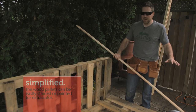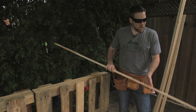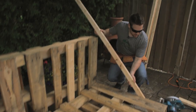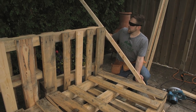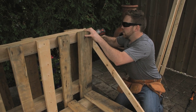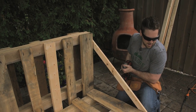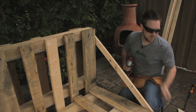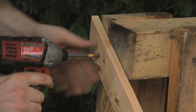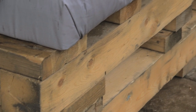So we've got everything sanded down, we're almost finished. You don't have to do this, but I'm going to add a piece of strapping to the end — it's just going to sit on the end here nicely and finish off the end of your couch. Don't go too far; you don't want to split your wood. They're just going to sit on the end and finish it up nicely. A couple cushions and a foam mattress — dress it up and you've got yourself a nice pallet bench.